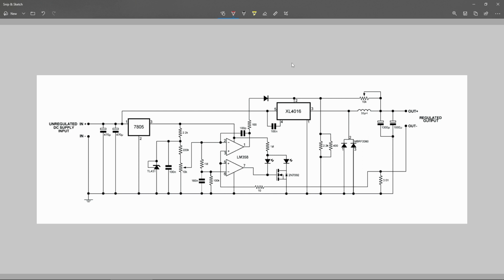Then you have this voltage divider right here and the basic circuit for the buck controller. So this is not as complicated as you might think looking at it the first time. And as you know, this is a shunt resistor used for current sensing that comes into this control loop. We know that the set point must be the set point of a current controller, not voltage. So this guy should be our voltage control potentiometer. Well, let's just test that.